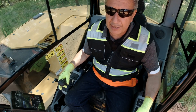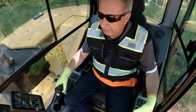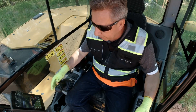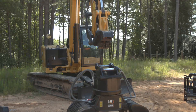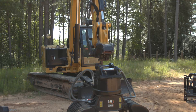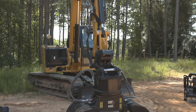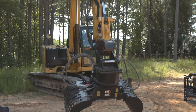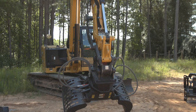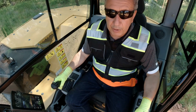We're now up in the next-gen 309 CR with the high flow, which is a dedicated aux pump. My dual lock coupler is locked at the moment, so I'm going to go ahead and unlock it. To snap on to a dual lock coupler, you want to rotate back and come down on top of it. Once you hear that click, you can go ahead and pick it up. I'll roll over and go ahead and re-lock that wedge — beeping goes off once again.